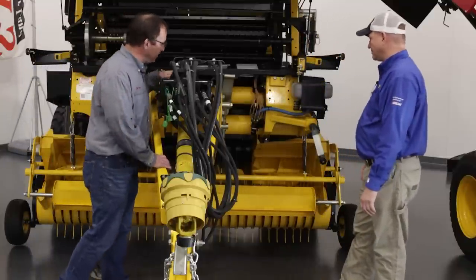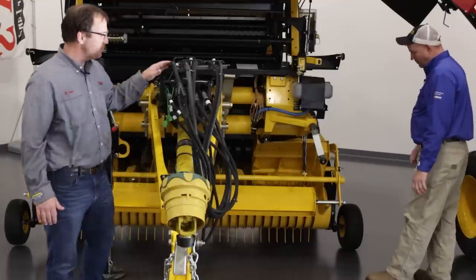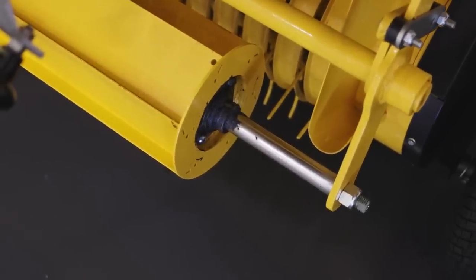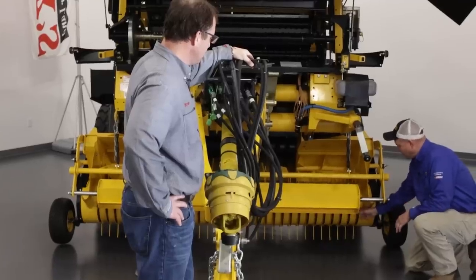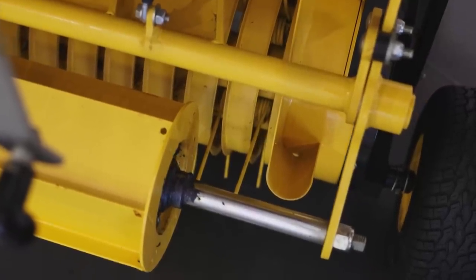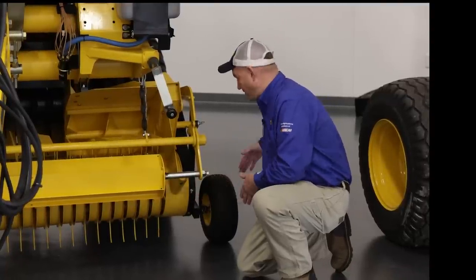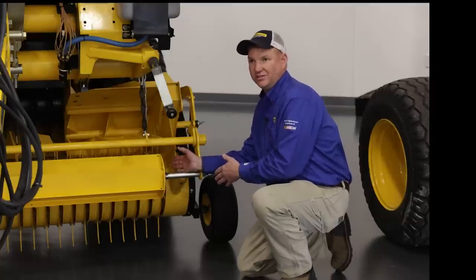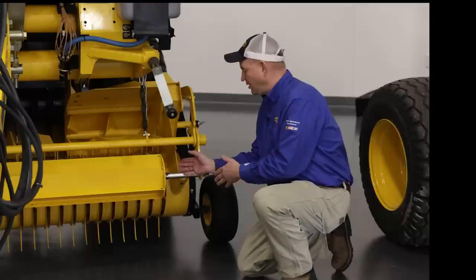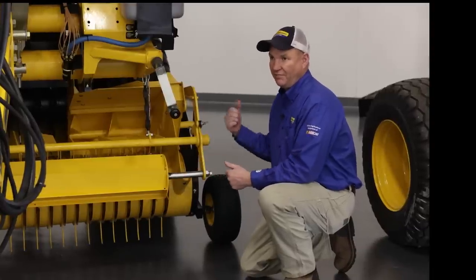Looking at the pickup, the rollers cut out and there's something going on at the side. What we've done is eliminated the pinch point by moving the roller wind guard in and putting a straight tine. The bands and the other pickup tines are the exact same part number as a roll belt baler, but we made this straight. When you're baling on a corner or with wind blowing windrows, you can get a slug of crop that comes in and pinches on the corner — then it plugs. Rather than spending half an hour digging out the baler, it's better to just let it go and come back around to get it later. Once again, all about uptime, no downtime.